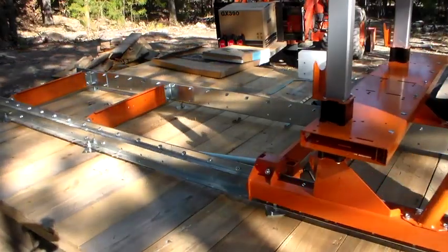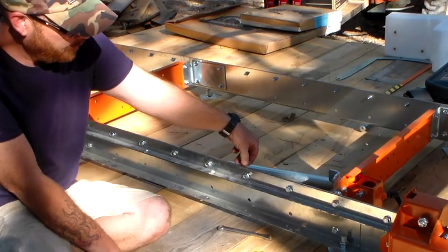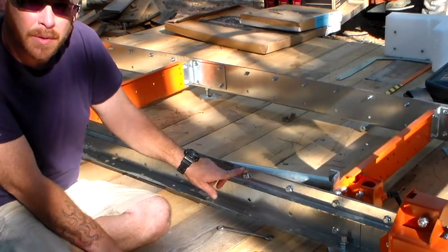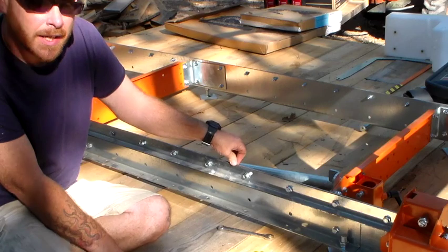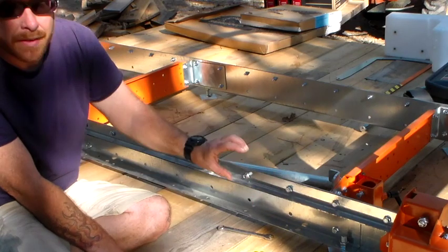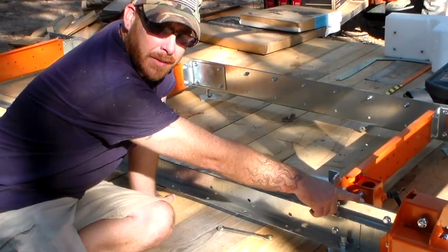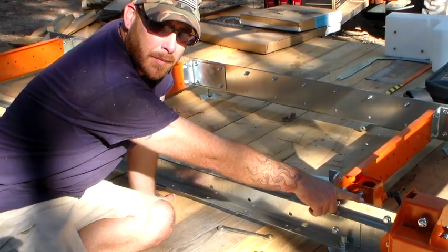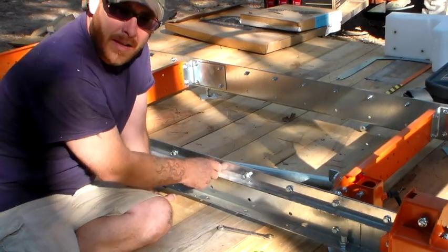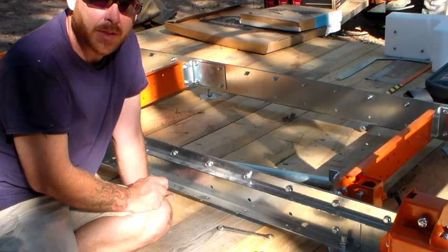Still doesn't feel right. I found a spot in the rail that wasn't quite level — the retainer rail was a little bit lower than the main rail, and it was causing the carriage to get a pinch point between the underwheel and the carriage wheel. So it got tight right here and didn't want to roll — this joint here was a little uneven. So I filed it, made it better, but it still didn't want to roll quite right. I've taken these bolts loose, straightened it where it needs to be, retightened, and I think we'll be in good shape.